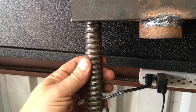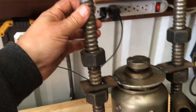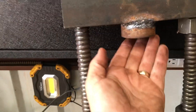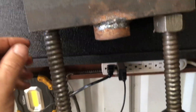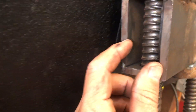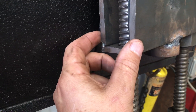This is coil thread rod — you can buy this at Maxwell Supply in Oklahoma City, which is a concrete supply company. They use it for braces and that kind of stuff. I drilled or burned a hole through here — this is where the pin can actually press through. The problem I have is this is real close to the pin size, so the fit is tight.